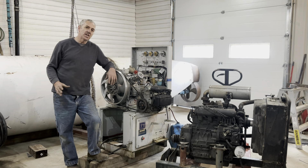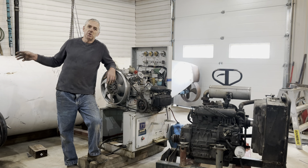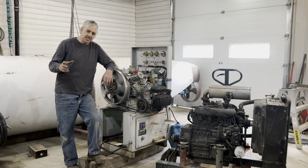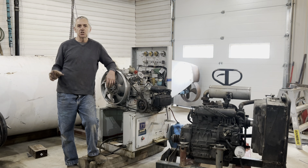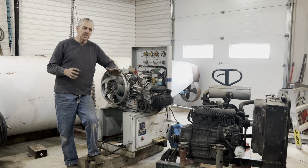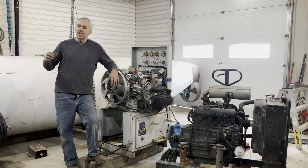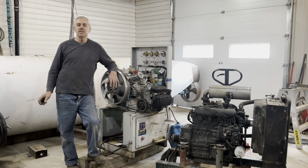The way I'm going to do this: I have another hull section outside from this tank, which will be welded on at a later date once I don't need such great access. So I'm going to take that hull section and set it up in the shop, and I'm going to mock all of this up in that short section, because it's really easy to work on it then. Everything will just fit into place, and once it's all put together and ready to install in the sub, I can pull the submarine hull out and slide the whole pre-made assembly in in one piece.